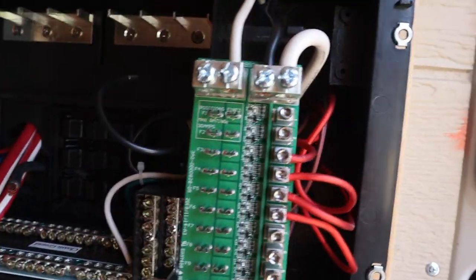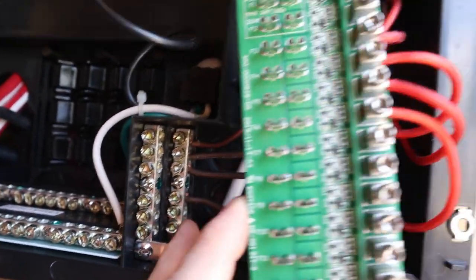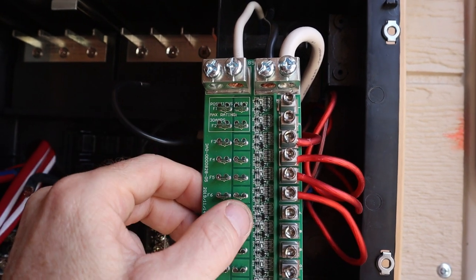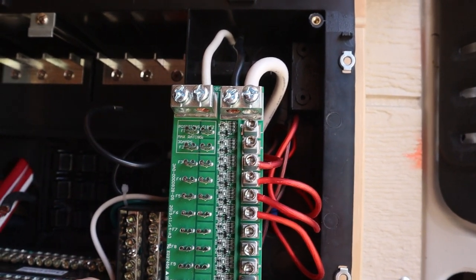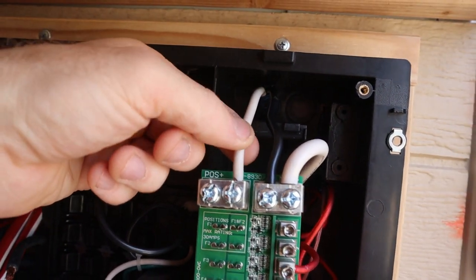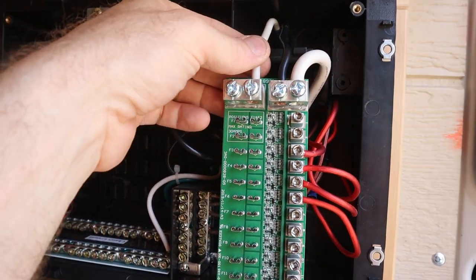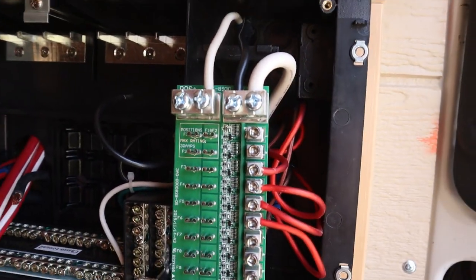Just strip off about a quarter inch and then screw it into the positive terminal. The second one is for my vent fan — my ceiling fan — and then the negative goes in that spot. You unscrew the screw, plug your negative in there, and screw it back in. It really helps to loosen the board — it's a lot easier to work with. I've got all my DC circuits connected. All the reds — the positives — are over here and all the negatives down there. There's a total of 15 slots on this board, so you can run 15 different appliances.